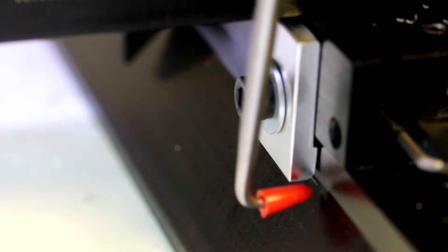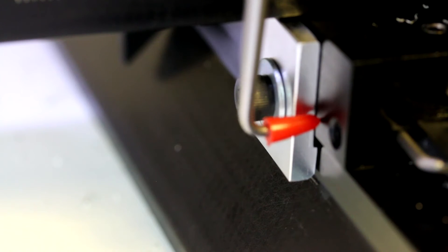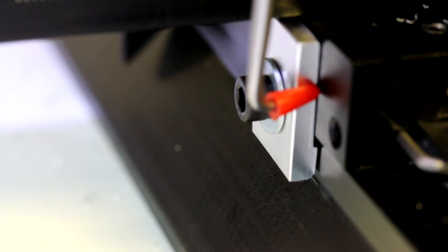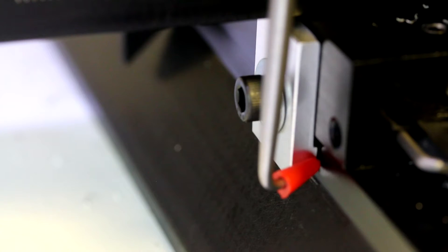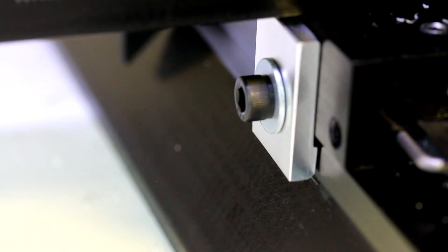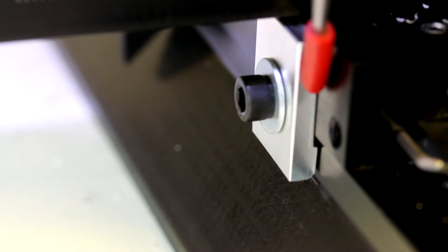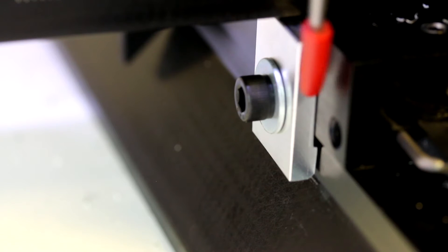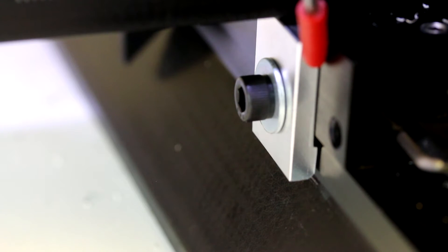The problem is this hole was located a little bit too high on the part, so the bottom edge would rub against the angle. That was quite easy to fix with a file — I just put a small chamfer on that edge and now it clears without any problem. The second issue is this step and shoulder is specified to be 30 thousandths, but on mine the saddle hangs out much further than the base, so at only 30 thousandths deep I'm nowhere near getting the contact I need for clamping. Rather than modify this, I'm going to start from scratch, using a little bit thicker material and base measurements from my mill rather than from the plan drawing.